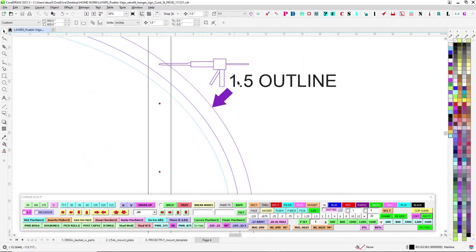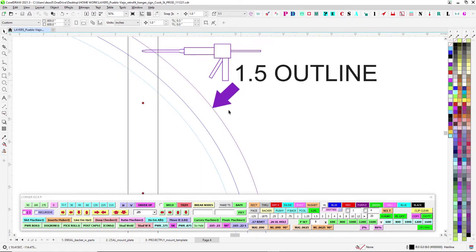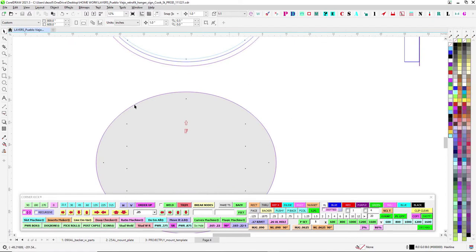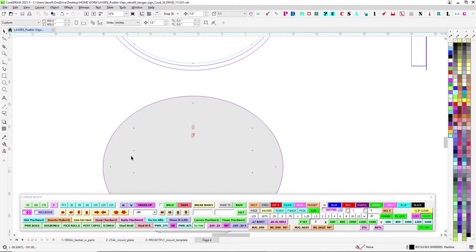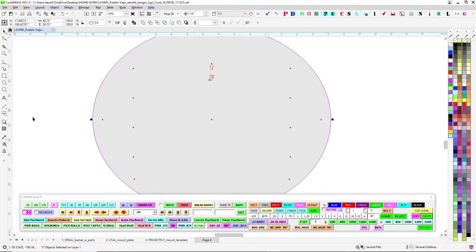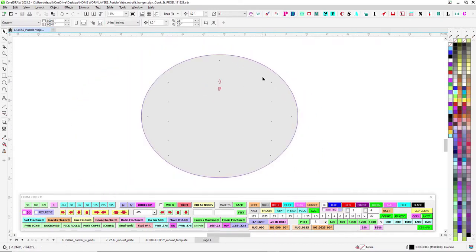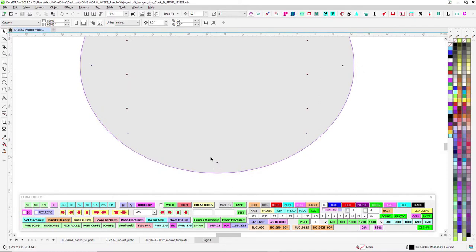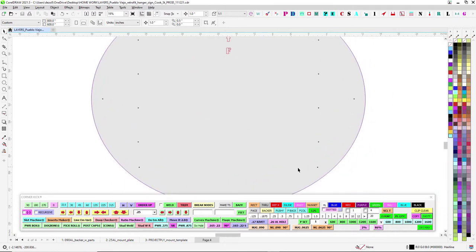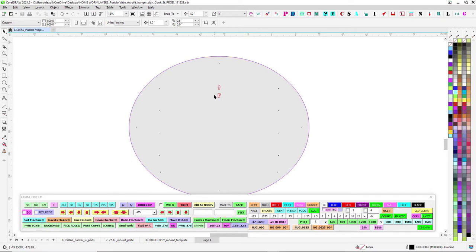If not, it's about an inch and a half outline — this is a CNC, but if you take your steel ruler and work your way around, you should be able to center this oval into the other oval and get it lined up. You're doing this right from the beginning — you're not putting legs on yet. Just take the raw oval, get your lines on it, and line it up. Then either slide it over and drill from the bottom, or flip it and drill from the back. Use these holes, do a 5/32 cleco, work your way around, and then you can cleco this thing instantaneously — disassemble and reassemble with ease.